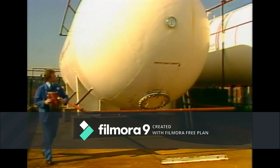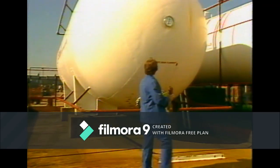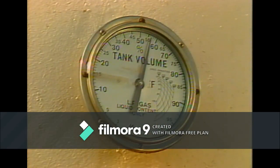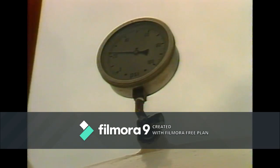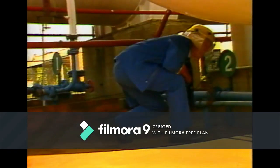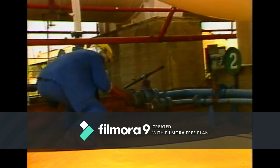The driver should now check that it's safe to discharge, that there are no leaks anywhere, and that there is sufficient ullage to receive the delivery. He should also check that the temperature and pressure are within normal limits. Always remember that putting propane into a butane system would result in a dangerous situation.